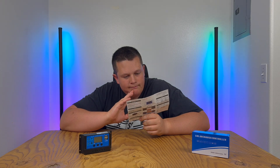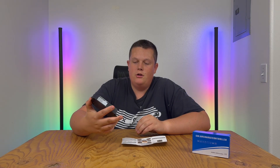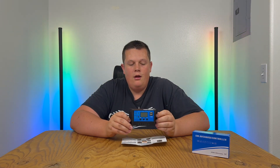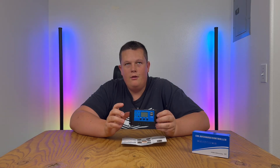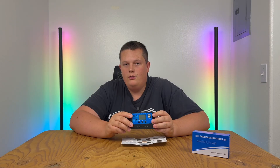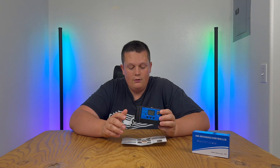That's a pretty good overview of what this solar charge controller can do — there are so many applications for it, and it's more typically used with lead acid batteries. With lead acid batteries, you never want to go below 50% charge, which is why 10.7 volts is way too low for the discharge stop.